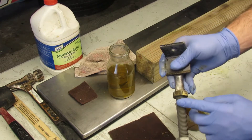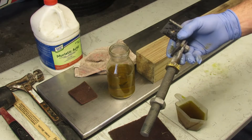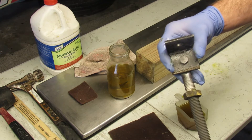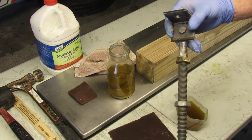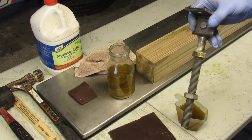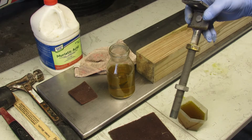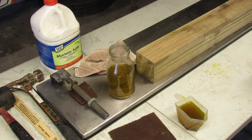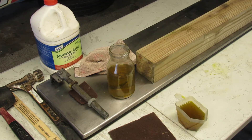The jar had sat in here and cleaned from there down. I'm getting ready to sand the whole trailer down, so this was just to show you guys an example of what muriatic acid can do. If you need to really get into it, please wear protective covering for your skin, but you could use a brush and brush it on rusty areas — it will take the rust back down to clean metal and save you a lot of work. You cannot use this on every surface or around certain things, so make sure you protect those areas because muriatic acid will dissolve them. This should take about 15 minutes to bring this drill bit back.